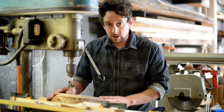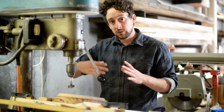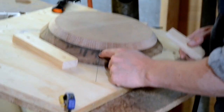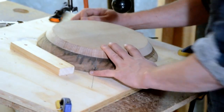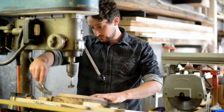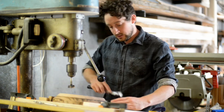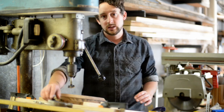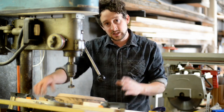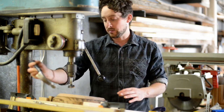It is very important that this is held down firmly, because this is a circular object and the drill is pushing in a circular direction — you'll find it will try and twist on you, so the wedges are very important. I've got my first line marked with my reference line, I'm going to put one wedge in, give it a few taps, lock that in, and put two other wedges in just so it's super locked in place. I'm putting the wedges on the high side of each of these blocks, which means that if the object tried to turn, it would be grabbing tighter rather than loosening those wedges — something to think about as well.